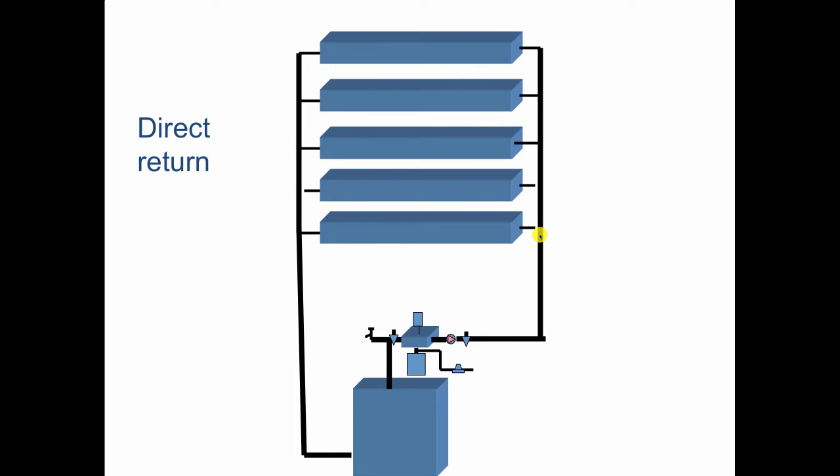And if it's 180 degree water traveling through an insulated pipe, the radiator on the first floor gets 180 and so does everybody else. So that's a big advantage in a large building over, say, running baseboard if you can't go over 70 feet, or running diverter tees where the water keeps getting cooler and cooler, lowering the supply temperature